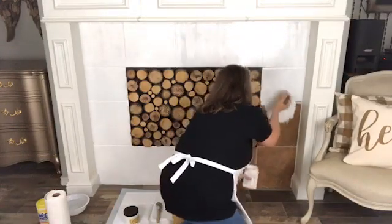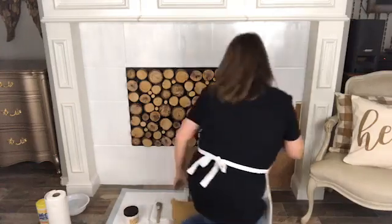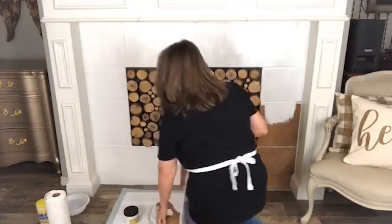And a good way to test any paint that you're using, after you paint a surface, if you reach over and touch it, if it is cool to the touch, probably means it's still damp. It has water underneath it. These are all water-based products. If it's still cool to the touch, it's still damp. It needs a little more dry time.